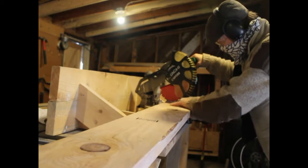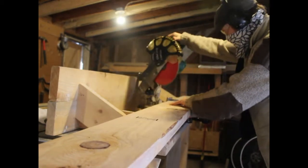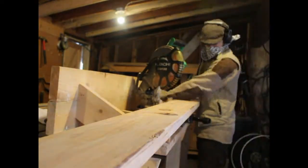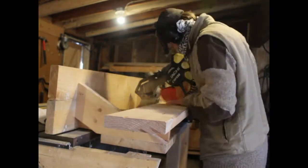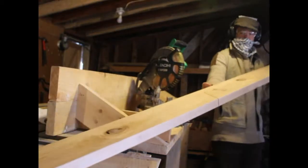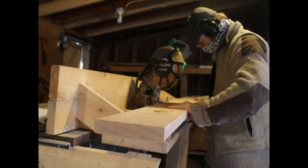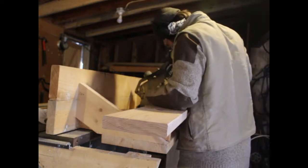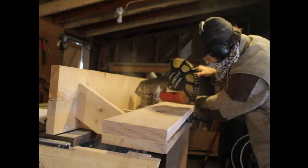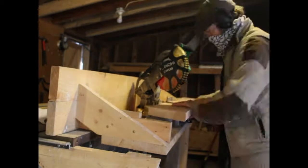Now I'm cutting out the sides. These are cut at 60 degrees — again, check out the plans for exact dimensions. My circular saw isn't wide enough to cut this 2 by 8 in one go, so I have to cut it first on one side and then flip it over and cut it the other way, which makes it a bit awkward to turn this large 10-foot board around. I need an entire 10-foot 2 by 8 just because of the height of the chair and the legs — it needs a little more than a standard 8-foot 2 by 8. The nice thing about a 60-degree angle is that, if you remember back to geometry in high school, it makes a three-sided equilateral triangle: 60 degrees, 60 degrees, and 60 degrees.